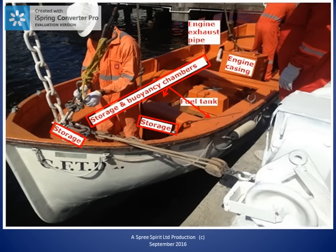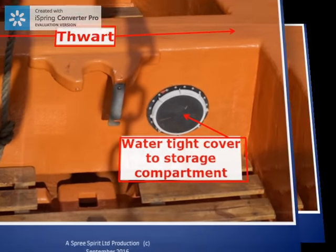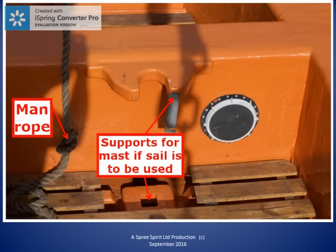Let us recap some of the parts of the davit. Here we see again the span wire that supports the man ropes. The man ropes are there to support persons in the boat when the boat is being lowered or hoisted. Here we have highlighted the davit head with the nearby arrows pointing to the davit head sheaves. We have also highlighted the falls and the falls blocks.